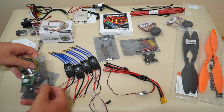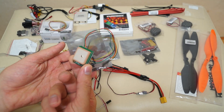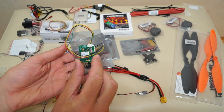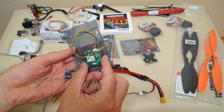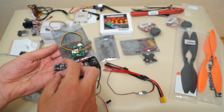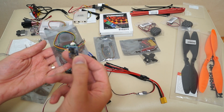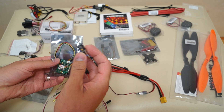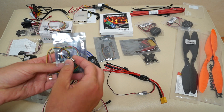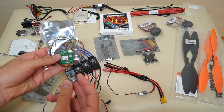Next is the GPS receiver, also from Creos — version 2. It comes pre-fitted with a cable. This is the FTDI programmer, which you have to use in order to upload the modified configuration file for the GPS using the U-Blox software.